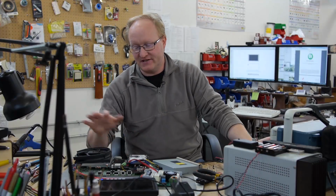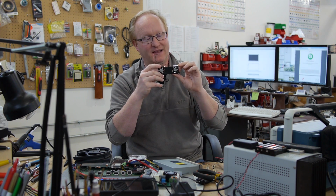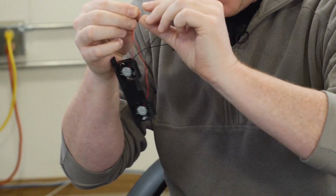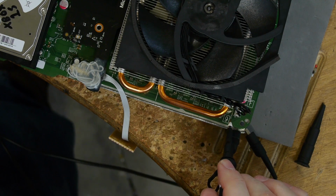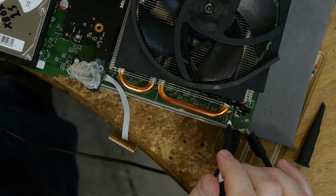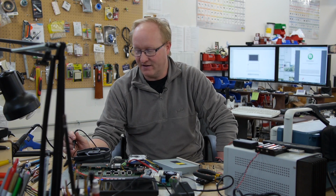I want to replace this large fan with 2 smaller fans for my laptop. So these are 12 volt fans, just like that one. Of course, they're a lot smaller, and they only have 2 leads each. The Xbox One fan has 4 pins on it. The first 2, this one's ground, this one's power. The next 2 are used for control. There's the sense pin, the 3rd one from the bottom. That one is the fan telling the system how fast it's moving, an RPM sensor.